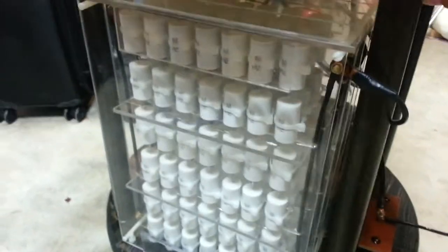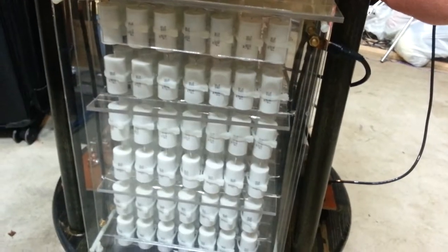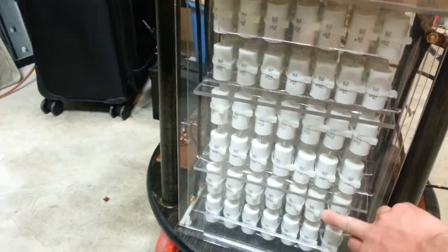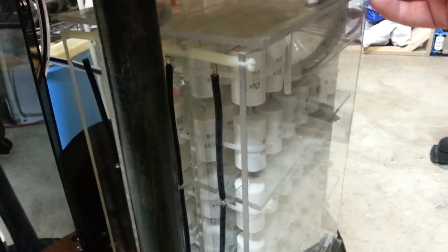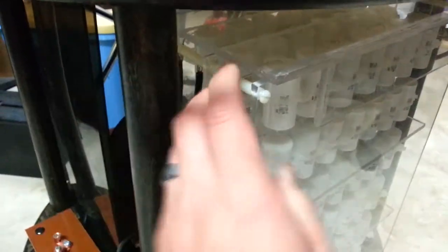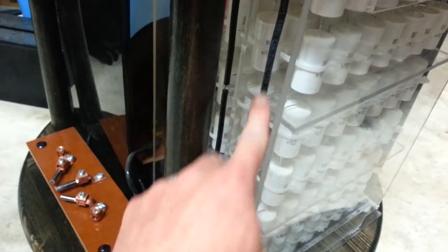My MMC — this is 140 942s. I have them in 14 in series, 10 in parallel. You can see here on the side I've got three rows of nine and then one row back here. I may or may not add more, and I'd like to adjust it so I could actually change my capacitance level. Right now it's all just connected up.